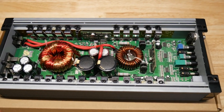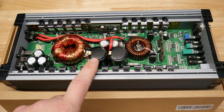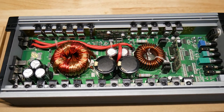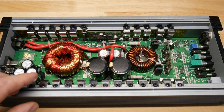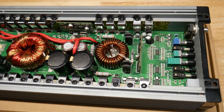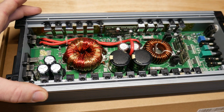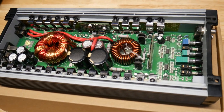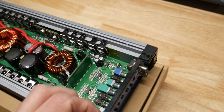Here's a gut shot of the amp, and I'm amazed how clean and nice this looks for the money. Over here we've got 25 volt 3300 microfarad caps, these are 105 degrees, 63 volt 4700 microfarad, and those two right there are 250 volt 100 microfarad. There are no instructions or paperwork at all in the box, but looking at the board it does have over-current protection and over-temp protection. Very tidy and clean — I was really surprised. Very good build quality, and this is all solid aluminum. It's not cheap — this amp is heavy with a lot of good heat dissipation. This does not look like a $75 amp. Even the Tiffany-style RCAs — very nice.